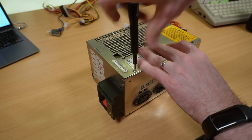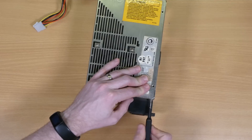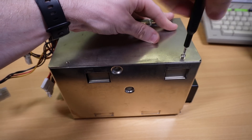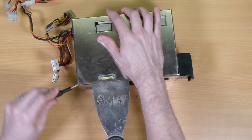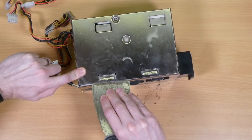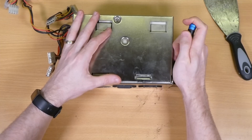While I like my hardware original, I don't generally consider the power supply to be part of that, and having it not blow up is much more important to me. Of course I'll be careful to keep the original innards just like I always do with all of my upgrades. After removing the screws, the back panel of the original PSU locks together with these two metal tabs, and I've discovered that a metal scraper is perfect for teasing them apart without bending anything or causing any further damage.